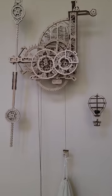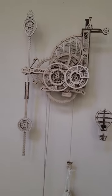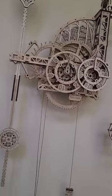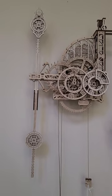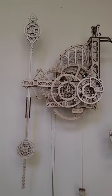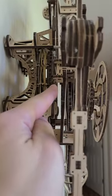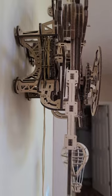There are a few things to keep in mind with this model. It's a lot of fun, but the title of this review should be: Friction is the Enemy. I had a bit of challenges with getting this thing to run and then getting it to run accurately. There is a piece right here that you may notice is not all the way pushed in, because when it was pushed all the way in, the clock would stop — something there was producing too much friction.